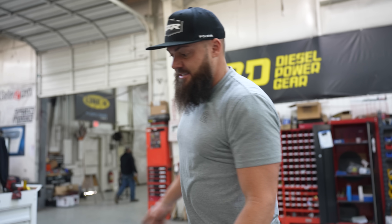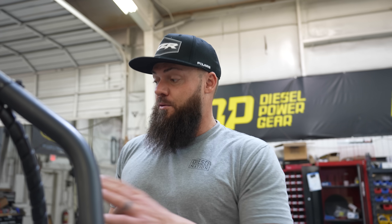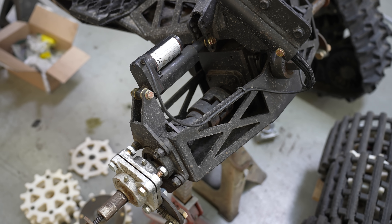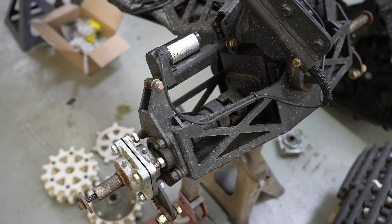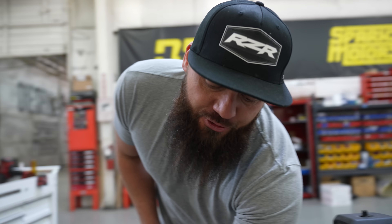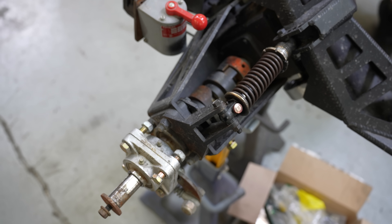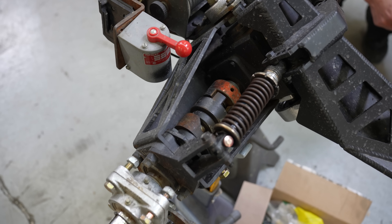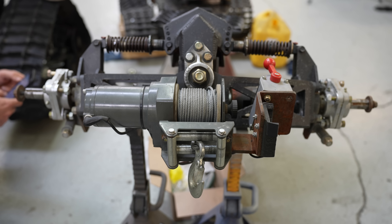Back to the board — it's got basically the option for two wheel drive or four wheel drive. The way that works is the rear drive line comes into this splitter box which then has shafts going out with lovejoy couplers that we can engage and disengage. We pretty much always leave the rear axle engaged because that's your drive axle. The front axle — as we thread these bolts out right here — it pushes a wedge in that basically engages or disengages those lovejoy couplers. This really is kind of like a Frankenstein, but also a masterpiece. It has a little winch on it — just kind of for looks, but it does work, maybe a 100 pound winch so it's not going to do much.